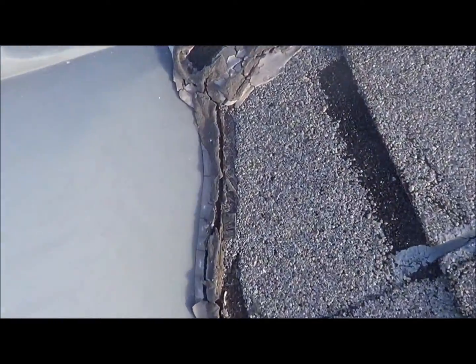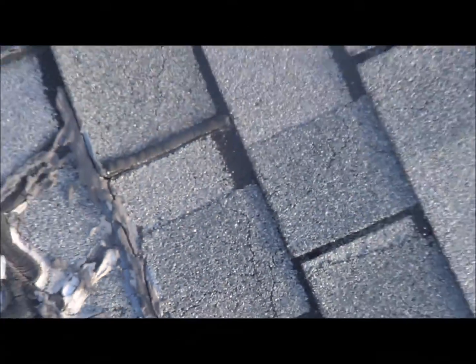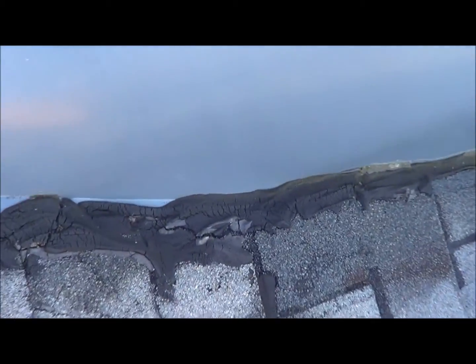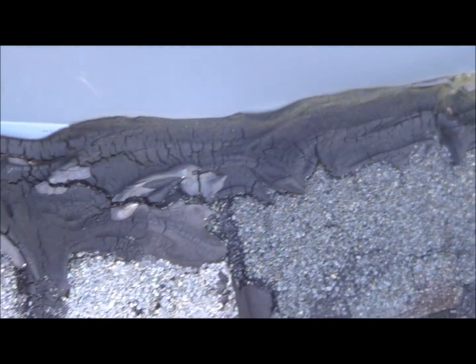There's where it's all cracked open. We need to take the shingles out from around this entire center dormer and reflash it, put ice and water shield. You can see where it's all cracked open — it's got a metal roof on it. Somebody has caulked across the entire seam here. We can recaulk the entire top seam where it's folded over.